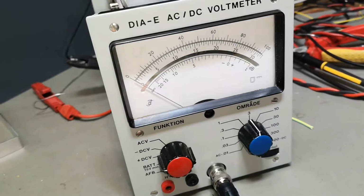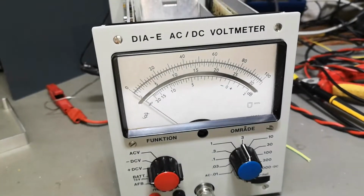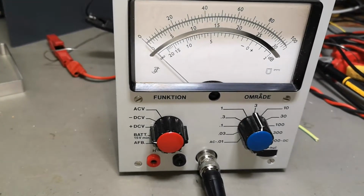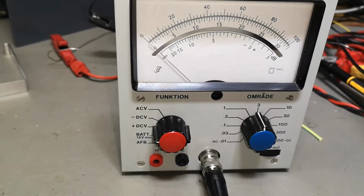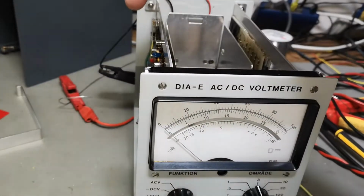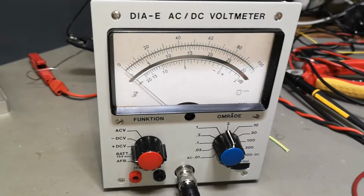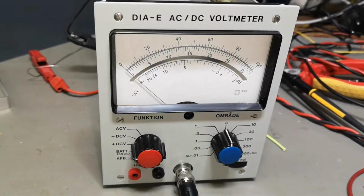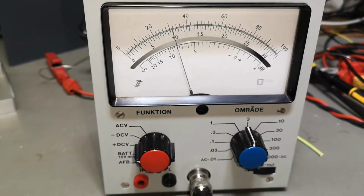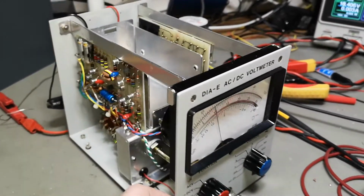And now look at the zeroing here, huh? And now it's running off an 18 volts supply. And I guess if I take this 18, make it 17, make it 16, it's not affecting this at all. Because there's a perfect balance in the way that I trimmed this thing, right? Go back to 17, 18. Let's give it 1 volt DC. Hubba hubba, yeah. So of course it works. All you have to do is trim it right.